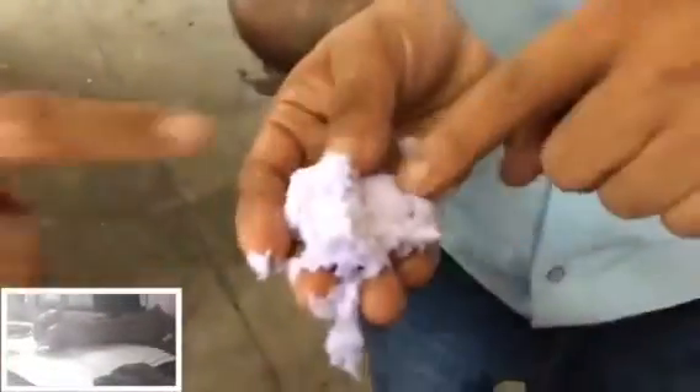What is the paper machine? We take the ready fibre, mix it with chemicals, and on the paper machine we add more than 99% water and less than 1% fibre. First, we have the wire part. In the wire part, we are taking out the water by vacuum. On the wire part, we can get a dryness of 20 to 22%.